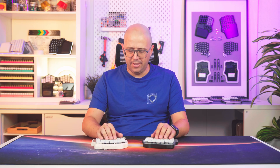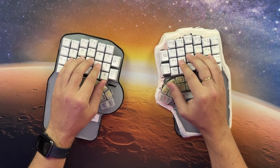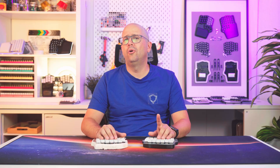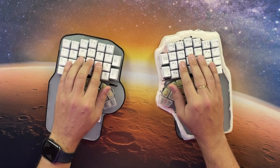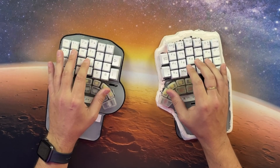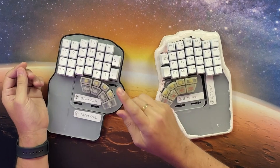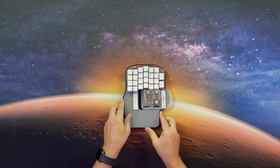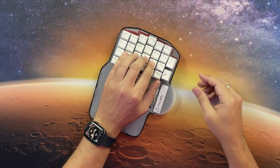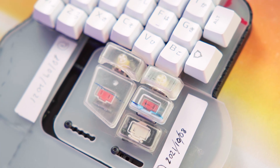Okay, the new arc for the thumb cluster seems to work. I don't accidentally press B or N with my thumbs, and the outer keys feel so much easier to press. Pressing the outermost key also feels very satisfying, although we must adjust the transition going back inwards. However, the most important finding is that the thinner keycaps make it uncomfortable for those who place their hands flat on the keyboard, which brings the thumbs down — they are too small. But before we fix that, why not try three rows? MX switch, low profile switch, and an ultra low profile switch. The three-height setup is interesting, but results in fewer, harder-to-reach keys and would be really complex to manufacture. So let's go back to the previous idea.